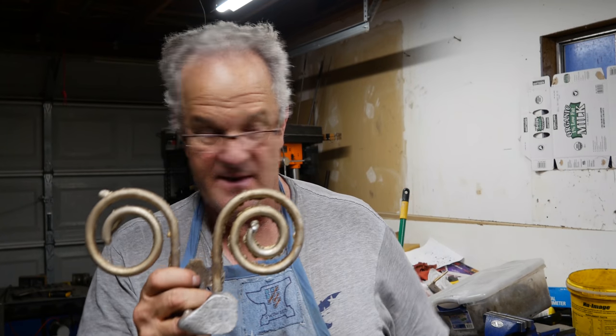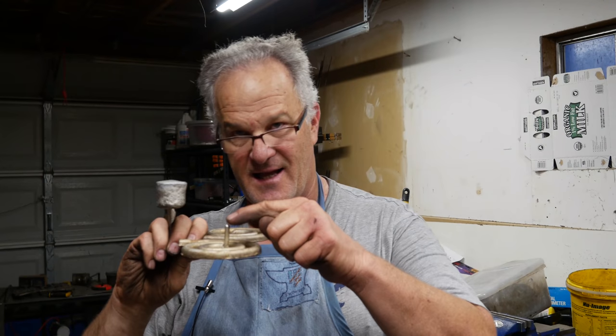Clearly a vent helped. Now I've had times in the past when I have failed getting parts to fill, and I put in vents, even if they're just tiny like this little quarter inch vent, and then I get success. So it would appear that with my sand, my oil-based whatever that is, a vent helps. Now, I'm telling you that because if you go watch Lucky Gen 1001, I'm going to abbreviate you to Lucky Gen, man. Sorry. If you go watch his test, it pretty conclusively showed with his setup, he doesn't need vents, at least on a test like this. Okay? So, there you go.